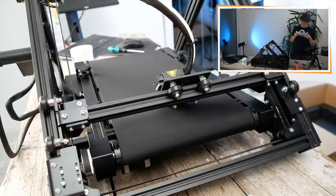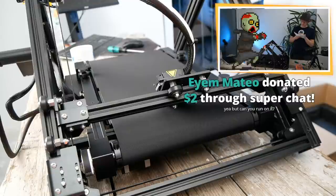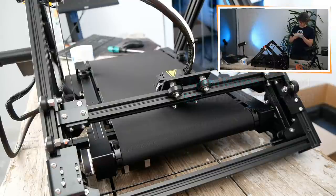Push the limit switches against the X sliding block to lock the limit. That's what we currently did. Press back on the screen to get the printer back to the origin. Adjust the Y end stop adjusting screws according to the position of the nozzle relative to the belt, after back to the origin, in order to make sure the nozzle contacts with the belt rightly. Then tighten the Y-axis end stop screw. Leveling finished.